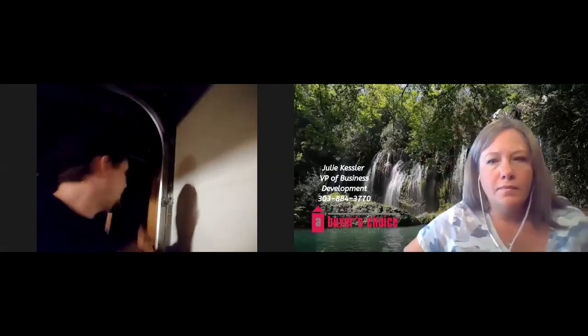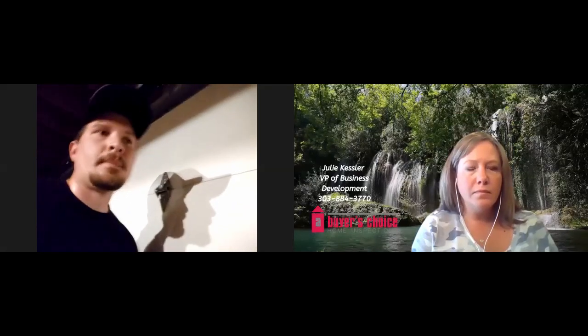The first one is you want to make sure the door is closed all the way, and then you pull the emergency release. Now, normally the emergency release is going to be overhead, where the opener is, where the opener rail is. Mine is mounted to the side, so I'm just going to click it over here real quick. And then once you release it from the opener, you want to lift the door halfway by hand.